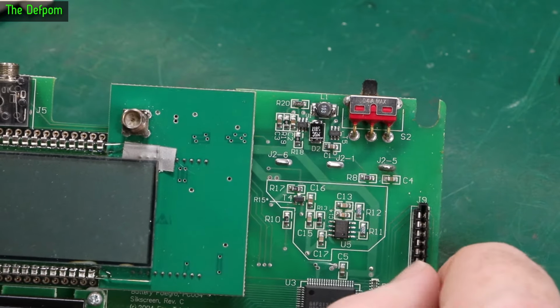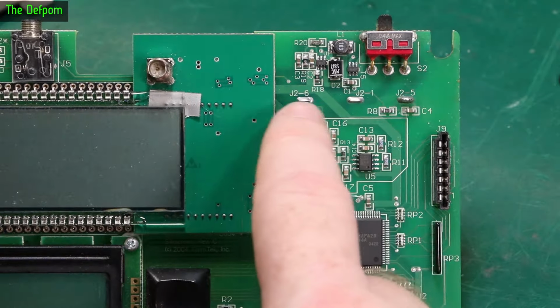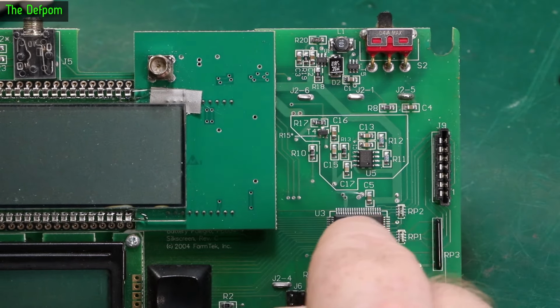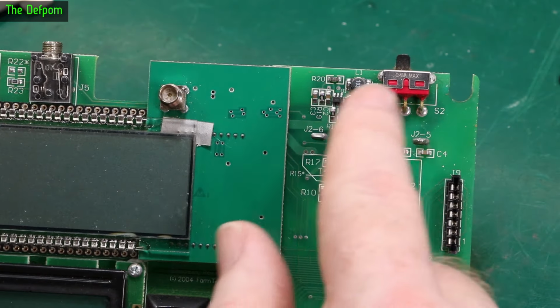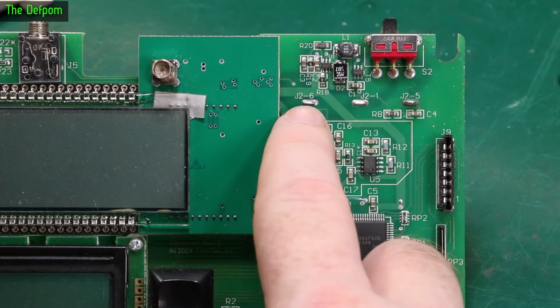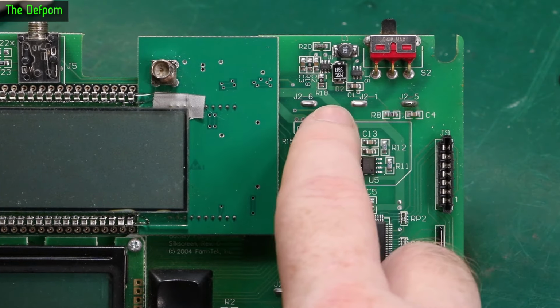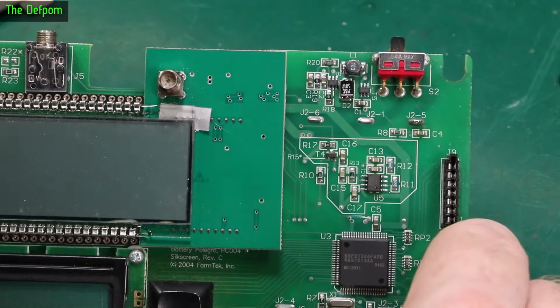I've never actually looked these up, I should do that, but there's obviously some kind of voltage regulator, it's doing something. I think that's like the main supply rail coming down here. Maybe it's 5 volt rail. I really should check that actually and make a note of that. But I'm thinking it could be something affecting this because of the battery leakage. They're the pads for the battery right here. Right, those are connections. So being right there seems awfully coincidental to me.